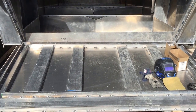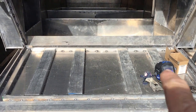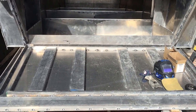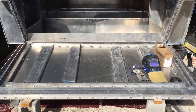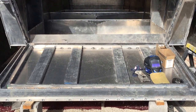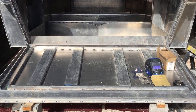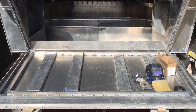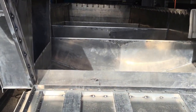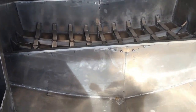One quick thing about this landing craft door: I'm going to put some one-by-two rectangle tubing across it, then put a piece of eighth-inch sheet metal over it. This is a work boat — I want to be able to pull things off the beach and have them easily slide up onto the boat, so there'll be one more piece of metal that completely covers that to make it smooth.